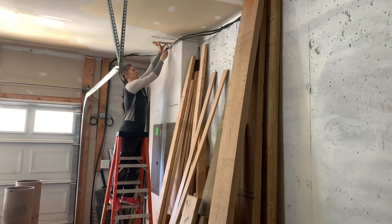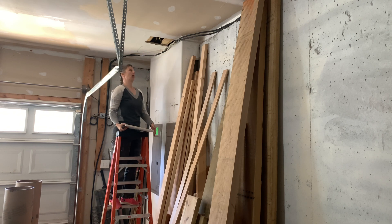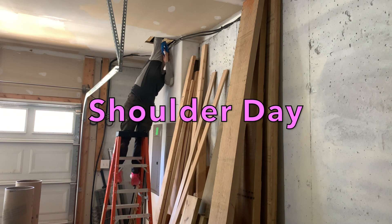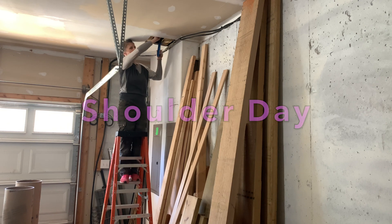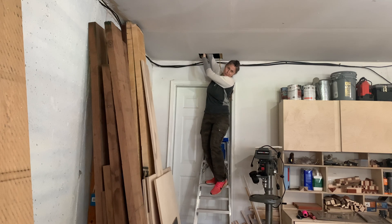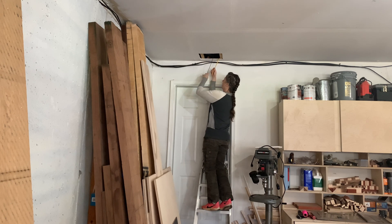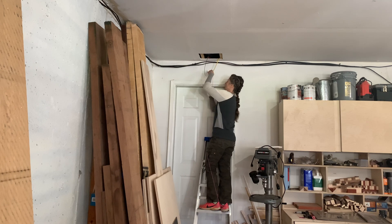I'll use an access point that was already in the ceiling over near the electrical box. I'll use the fish tape and pull the wire over. Pulling electrical wire is a great workout, so no need to go to the gym. If you get really lucky, you catch the fish tape on the first try. Even though the fish tape has a hook on the end of it, I always secure the wire using electrical tape so that it doesn't get hung up in the ceiling.